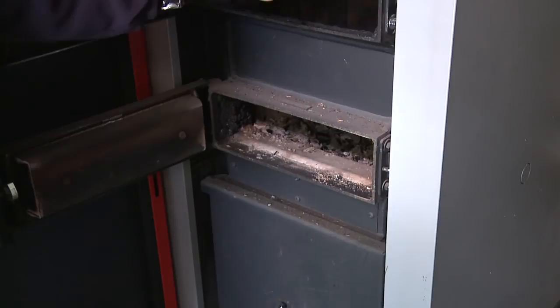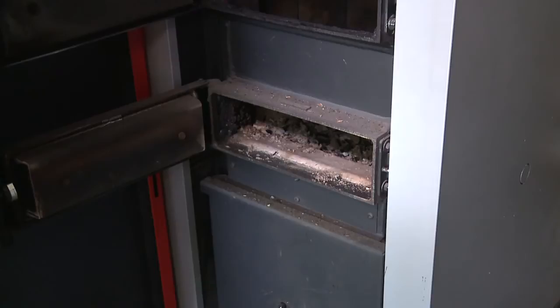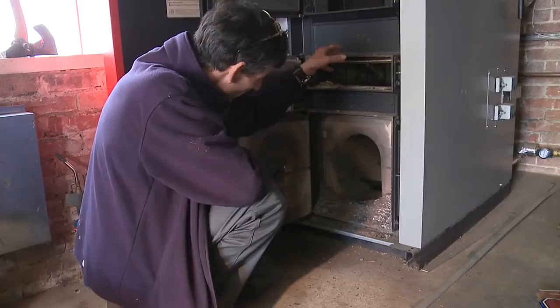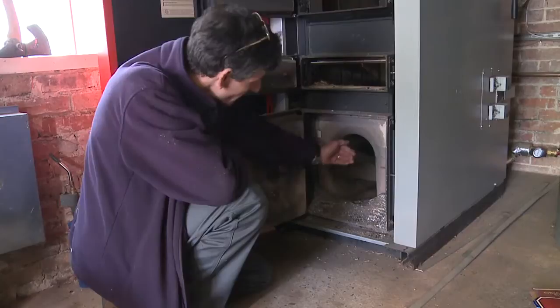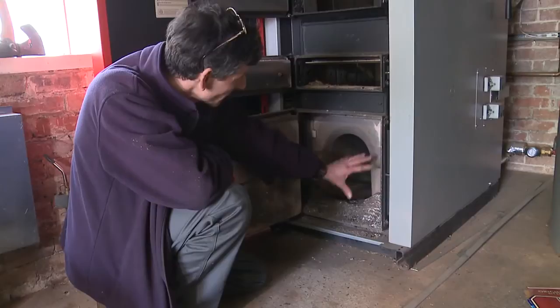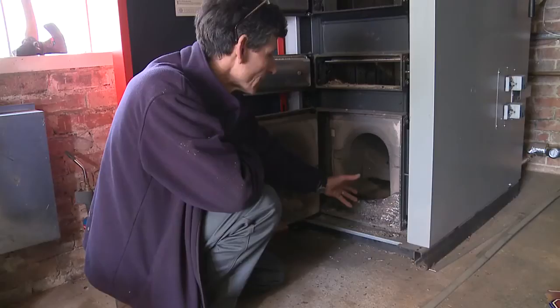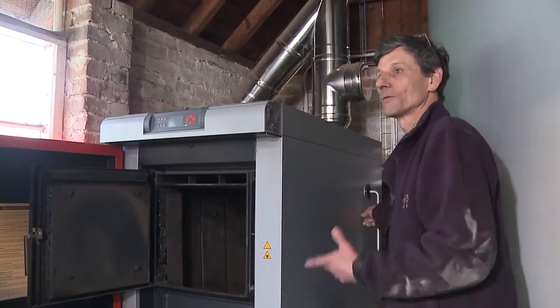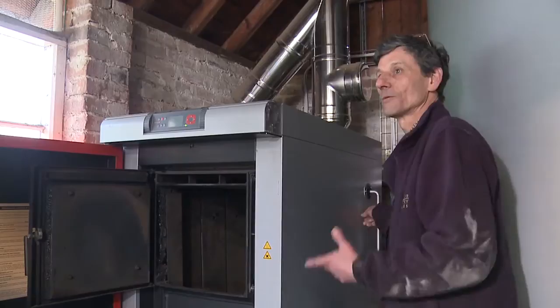We open this door and this one. The reason for the fan starting when I open the door is if there's any fire or smoke in here, it's sucked into this vent, ensuring you don't get any fumes or smoke coming out into the house. This is really where it's all happening - the gases and flames shoot down from the wood through a slot into this chamber, swirling around and back through, superheating the mass of fire brick and steel. The gases then go up the heat exchanger pipes at the back and out through the flue. This ash here is about three weeks' worth. Come the end of the month I'll sweep it out onto the roses. Every time we light the boiler you just give the cleaner a waggle - about eight times is fine and that's cleaned all the heat exchanger pipes.